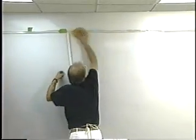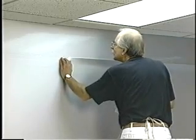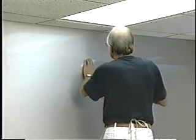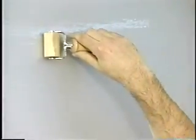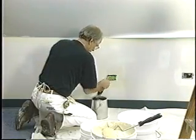Remove excess cut-off material and set your seam. It's suggested to start in the middle of the wall and work the seam left and right. There will be less chance of extra material buildup that might cause a bubble. Do not overwork the seam, which may force the adhesive out from under this area and cause an indentation at the seam. Next, paste the last wall section.